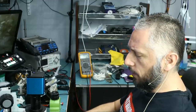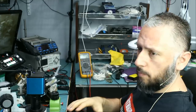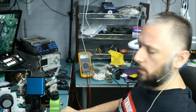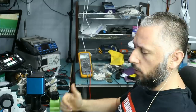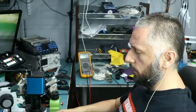Here we have an HP Spectre X360 that came in for no power. Big Boss tested this laptop before he gave me the board, and he said the amp meter is reading 20 volts at 0 amps on both ports. So both ports are able to negotiate with the board, and the voltage is 20 volts, but the amperage being drawn is 0. 0 is not good.